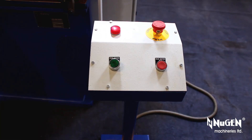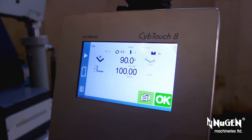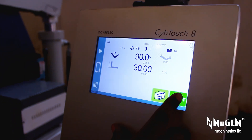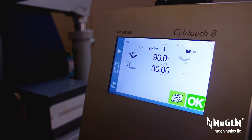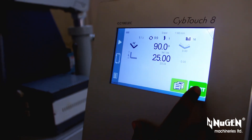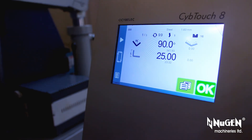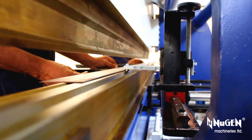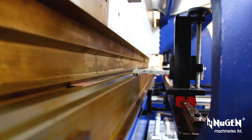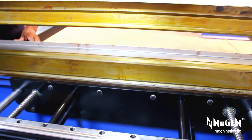Turman's numerically controlled hydraulic press brakes are equipped with renowned European make CYBELEC touchscreen controller, servo motor, servo drive, high-precision magnetic linear scale and ball screws. The controller memorizes 50 punches, 50 dies, 200 programs, 24 sequences per program, and 10 materials. This enables the operator to bend jobs with one to eight bends on each edge in one setup. Automatic retraction of back gauge on pinch point ensures flawless operation.